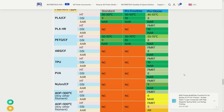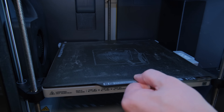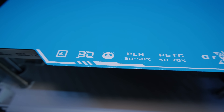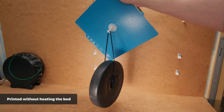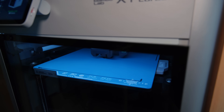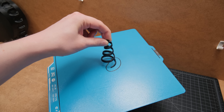BQ also provides a more in-depth material compatibility chart for these build plates and shows comparable bed adhesion, which is great to see. I am mostly interested in the Frostbite version because of the best possible bed adhesion and lower heating requirement that should allow printing PLA and PETG enclosed. It should also fix unnecessary electricity waste, and during a longer power loss the prints won't come off the build plate. If you work in the same room, you know how tempting it is to close the door and reduce the annoying fan noises — so there are quite a few very important reasons why this plate might be game-changing.